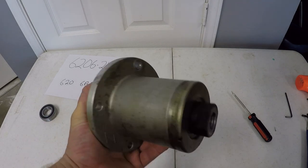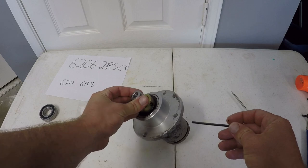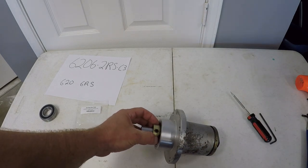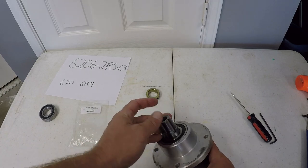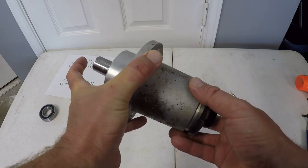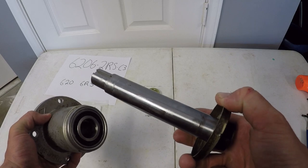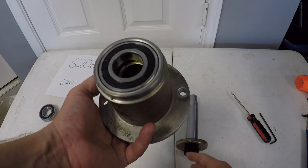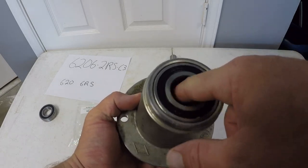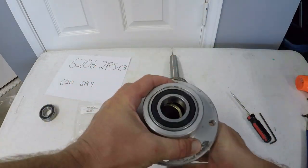So here we have the spindle, and this could not be easier. When you see one of these opened up, you realize how simple it is. Our first step is taking an Allen key and removing this collar here. Once the collar is removed, this is the top of our spindle — you can see where the lock washer was. This entire assembly, with possibly a little coaxing, with the blade end here and the pulley end here, will just slide right out. There's no reason not to grease this. That exposes our spindle, which is just a big hollow piece of metal with a little collar in between and two bearings that sit right here and right here.